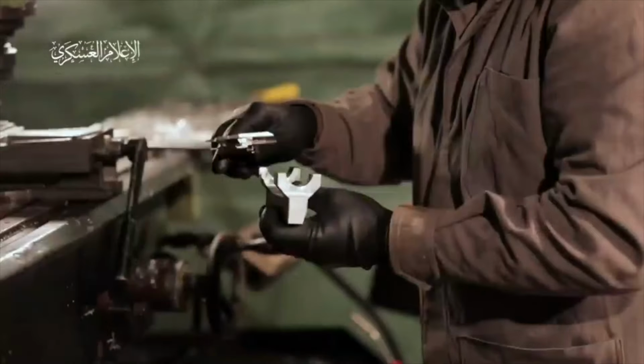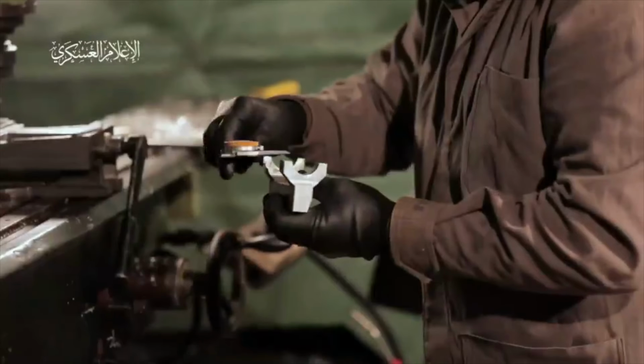They've taken what is either steel or aluminum, I'm not sure which. They're cutting an overall profile, and then we see a shot first where the guy's pulled one off of the mill and he's measuring it. Like, let's measure a random part to look good on camera. This is the beginning of a scope mount. And I think if they're manufacturing anything for real, I think it's scope mounts, because we see the raw piece of material, basically the sort of an extruded profile, except it's not extruded, it's a milled profile.